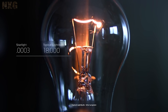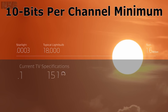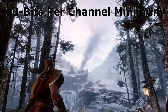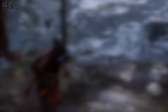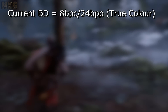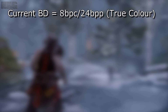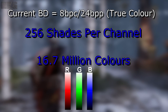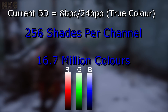One of the key factors in a TV being classified as HDR is that it can accept or at least process a 10-bit colour range or greater and output an image. If we take movies and current standard Blu-ray, these are all encoded with 8-bit colour — true colour — for each channel within each pixel, totalling 24 bits per pixel. This gives 256 shades of brightness for every channel of the RGB value and each pixel from its darkest to its brightest, and like many things, bigger is better.